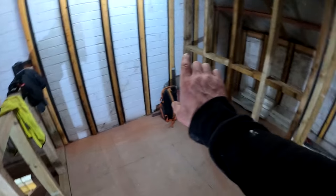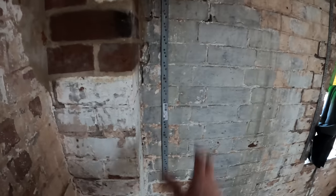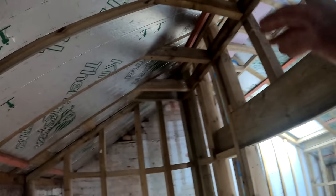We have got everything done that we need to get done. We're now ready for the sparkies and the plumbers who are coming on Monday. We've got our stud wall up across here. We're going to have the kitchen units run across there and then across there, and then there's obviously going to be a doorway into here which will be storage inside. The bathroom - as we said before - shower over here, basin and toilet there. There's going to be a little niche in here as well, so we need to do this out to carry the tray and put in two little bits of shelving for shampoo and that sort of stuff in there. We've also dropped the ceiling slightly here just to get some spotlights in across there and also extraction.